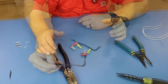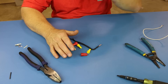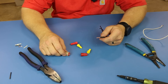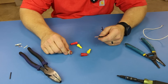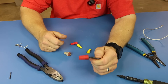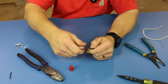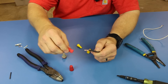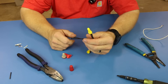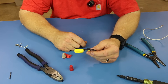Now I'm going to show you exactly what I'm talking about. You will have people telling you that what I just did is not the fastest way, but I will tell you it is the most secure way. A lot of people say you can just use your wire nut and twist — I'm here to tell you again, if you do that in my class, you will fail. So this is the perfect wire joint — if you put this wire nut on, all your copper is covered. Even the yellow, all the copper is covered. That is the perfect wire joint. When you're done, you just fold it out. Now you have a straight joint and you're ready to go — push it back in the box, call it a day.